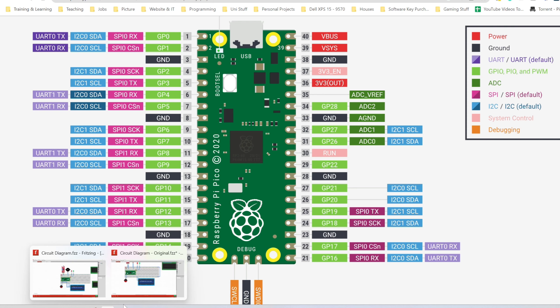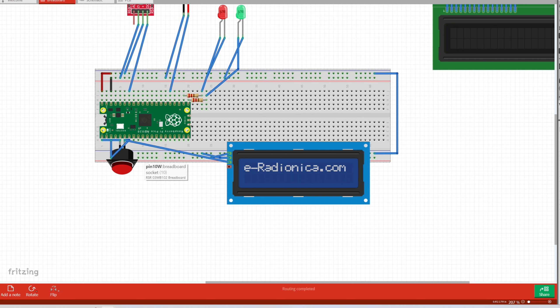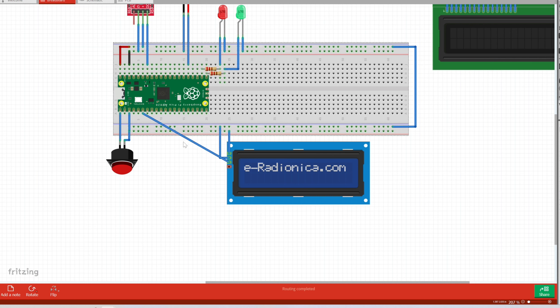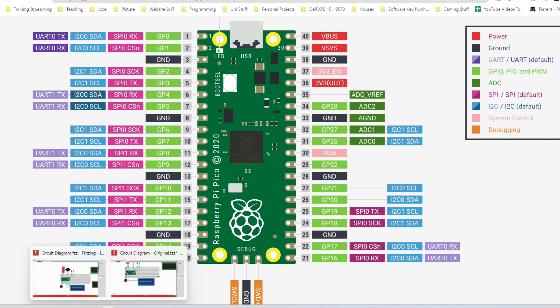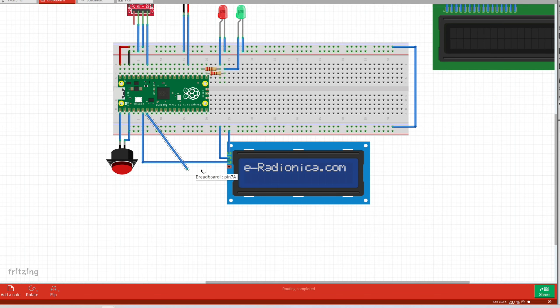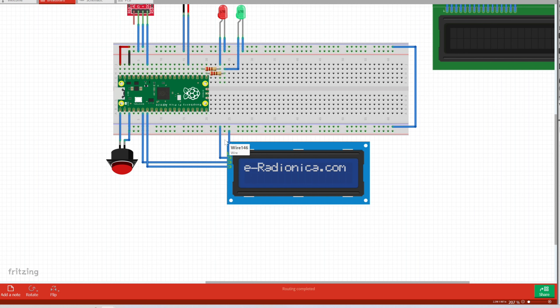Make sure you have the pins the right way around — that's a common mistake. SDA goes on pin 6. Then the last pin is SCL, serial clock. From the data sheet I can use pin 7, which is right after pin 6 — perfect. I'll connect that from the LCD's SCL pin to pin 7 on the Pico. The wire overlaps slightly but that's perfectly fine. Now I'm all finished — I might change the wire colors near the LCD since they're hard to see.